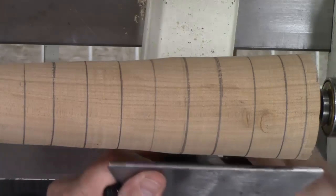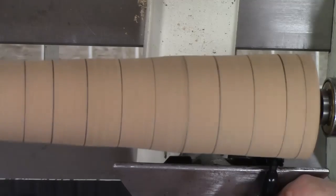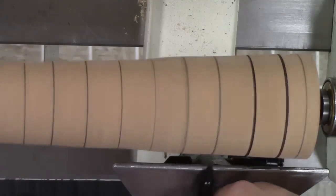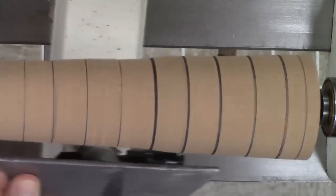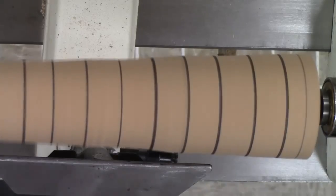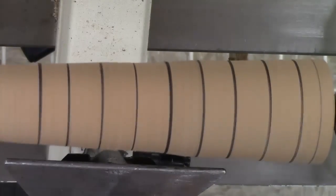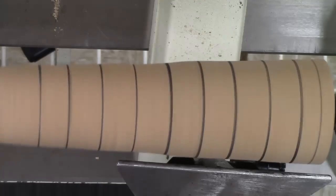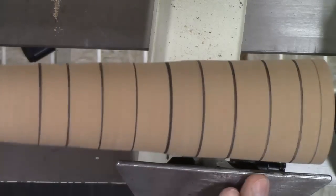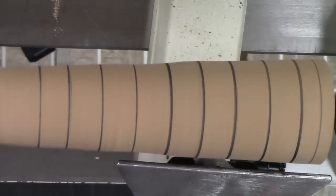I want to put some darker lines on this so I can see it a little bit better, because this is where I'll be taking the material from - it's either side of the line. The line itself will disappear. Even though this is end grain material I'm working with, I'm going to be using a bowl gouge on it. Because of the more steep or less steep angle on the end, I did my others with a spindle gouge and it's pointed enough that it's really difficult. With this bowl gouge, you can get in there and actually cut it out like you're supposed to.